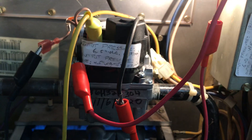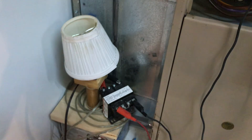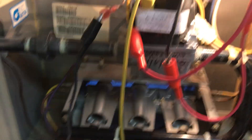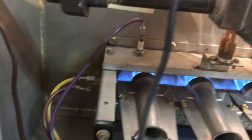That's interesting. So even if the lights go out, the furnace is going to stay running because I have the gas valve powered up by the transformer. The only thing I don't have is flame proving — proving of the flame with the flame sensor. The flame sensor is over there; what they call flame rectification. If that goes off, I have no way of shutting off the gas right now.